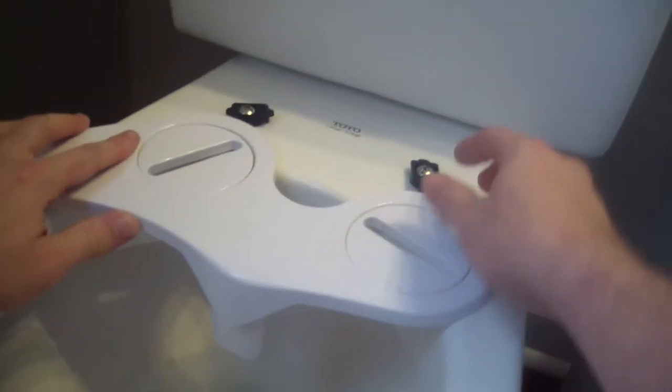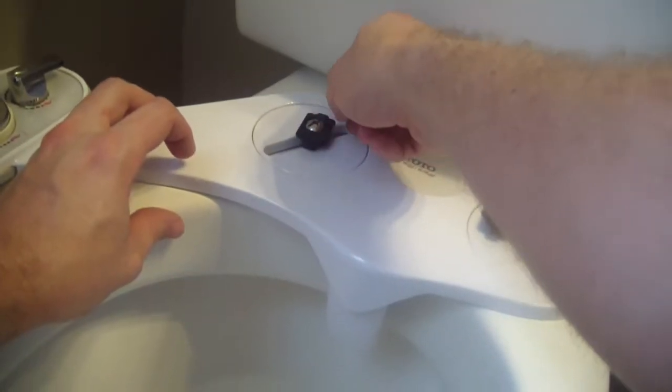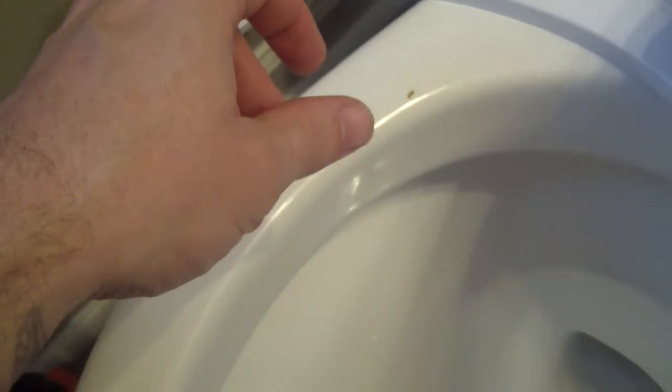Take your bidet — those bolts go straight through it. Drop that down, drop that one down. And here's a step I almost missed: this is where those little rubber gasket washers come in. They just slide over there to cushion it a little bit. Here are the toilet bolts coming through from the bottom, and this is the wing nut going on there. Use a screwdriver on the top to tighten it down. Make sure it's tight — you can't have your butt slipping off of there.